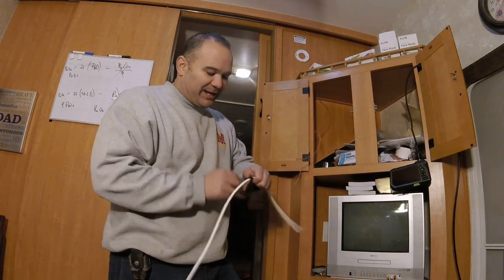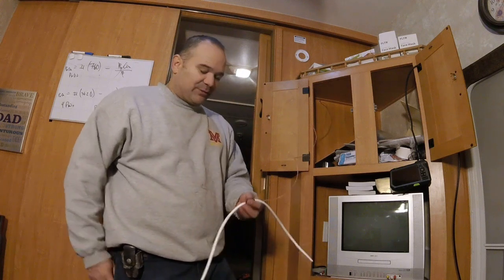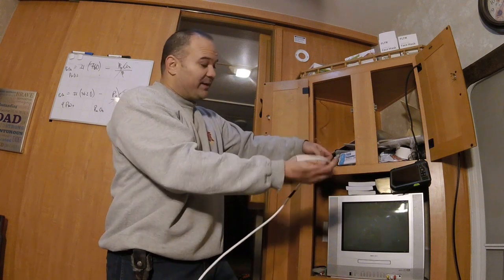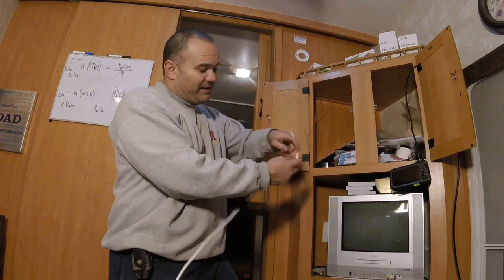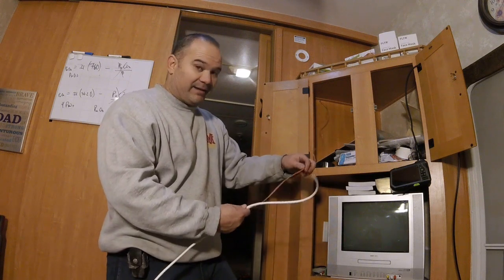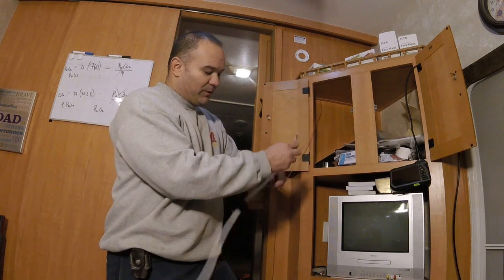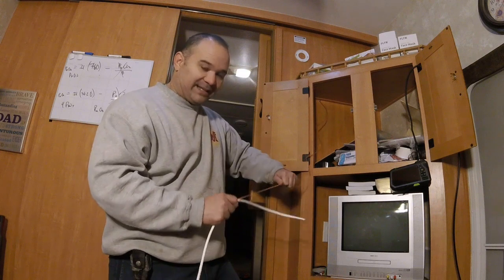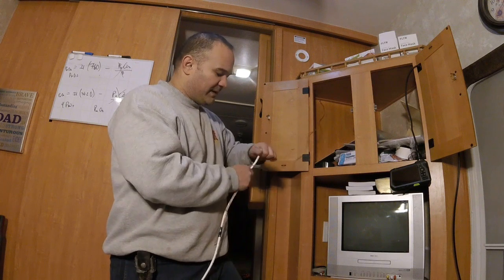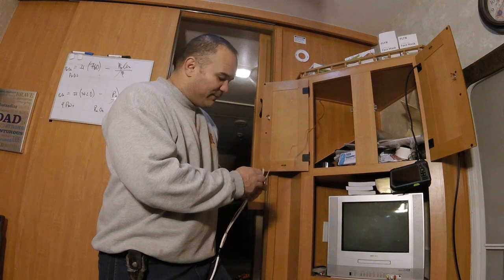I don't typically do half hitches when I'm doing one wire, but I'm gonna show you guys how to do it. Okay, so what I do is I just tape the back of the wire like this, and then you're just gonna put three twists in the wire, three twists in the string. Right here, boom, there's one. So if you do a half hitch wrong and then you pull it, it'll come undone like that, right? So when you do the half hitch right, when you pull it, it cinches on the wire, just like that. And just one little twist. One little twist. One, there's two. There's three. Now, when you tape down your half hitch, your string will break before your half hitch comes out.